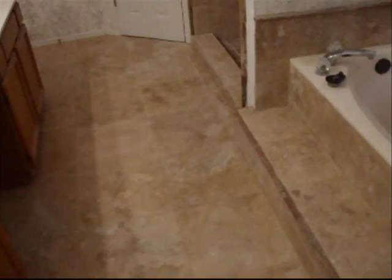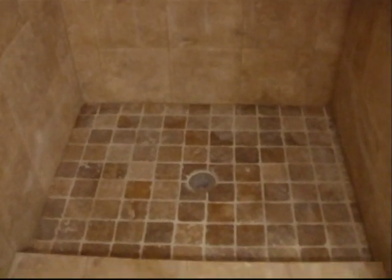I missed out on doing the video from pouring the shower pan and all that stuff, but I just skipped that. So I'm done — got the little strip there, 16-inch tile on the floor. The tile is on the step up there with a little trim around it, flush with the top of the tub, and a little trim around the backsplash. Got a nice shower, and it's almost 4x4 now — I think it was 4x3 before, so we managed to get it out. Remember that edge kind of went out at 45 — so we straightened that out and we've got edging on that. Nice new fixture, and of course what I'm famous for is my niches. I always do the diamond — I always put my floor tile up in the diamond, back-cut that and set it in there, and then trim around it to kind of frame it out. And that's the floor, so that's ready to go.